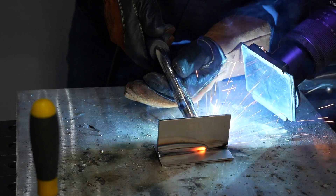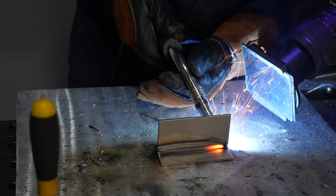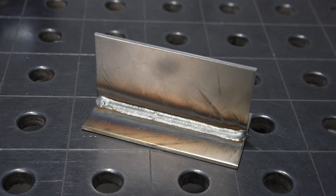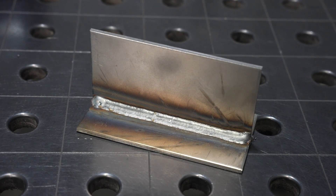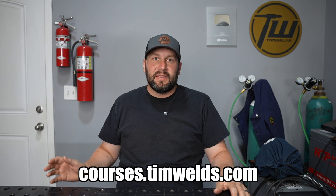When you put all of these elements together — running with an appropriate stick out, a consistent angle, and a steady travel speed — that's going to give you the right size weld and something that's really nice. It really is as simple as that, though it's not always easy to do, so it takes intentional practice with each of these elements of technique to really get them down. Get out there in the shop and try these things out. If you want me to walk you through step by step — setup, welding common joints, and each element of technique — check out the online courses linked in the description. If you don't like them, shoot me an email and I'll give you your money back. Thanks for tuning in!